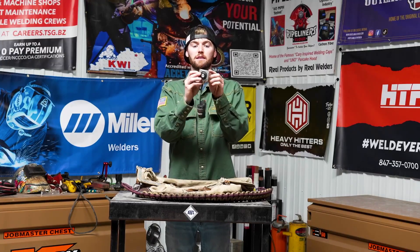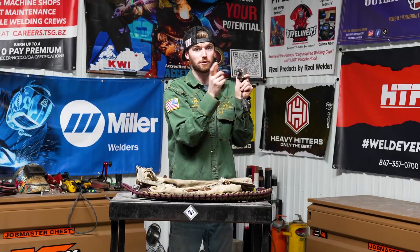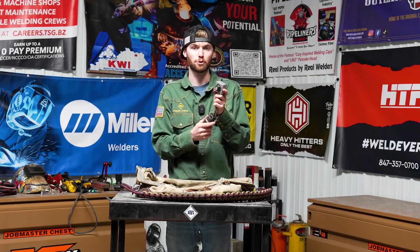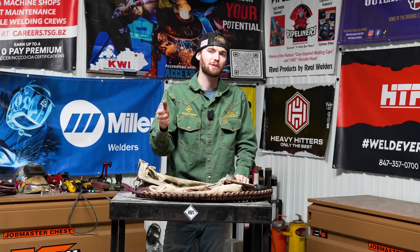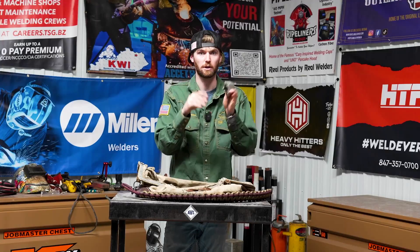The next thing is a remote. Whenever you're up in the field making welds, you don't want to run back to your welding machine to change the temperature, or yell down at your helper or fitter. I like to be in control of my temperature without going through anybody. I always have my remote hooked to a cable that goes to the welding machine, so right at the weld I can adjust my temperature. It's probably one of the top three tools if you're making field welds — when you're in a tight spot and really need to finish a weld, going down to change the temperature is such a hassle.